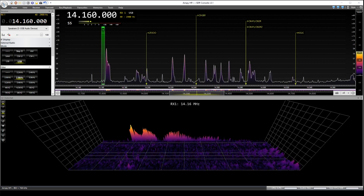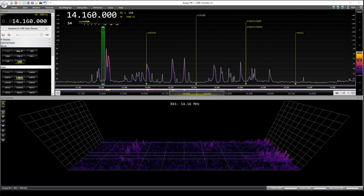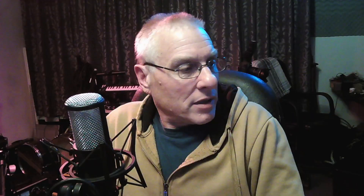Okay, that's basically it, folks. That's all I wanted to show you. So that is how to set it up so you can get up and running. You need a patch cable: 3.5 to 3.5 TRS if you're coming into the line in at the back of the computer, or a 3.5 TRS to quarter-inch TRS if you're coming into an external sound card like a Behringer or whatever. You can use any external sound card. You may be able to use two of these - I haven't checked that out and I will let everybody know. $10, plus a patch cord.